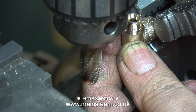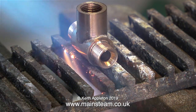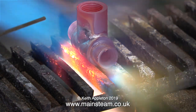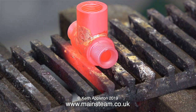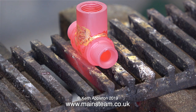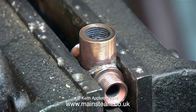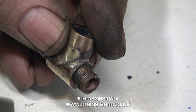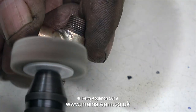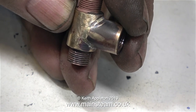When I looked in my box of assorted end mills I didn't have one that was half an inch in diameter, but I found a metric one that was nearly half an inch and had to move it from side to side a bit. All will be well once it's silver soldered — and talking about silver soldering, here we go. As usual I'm applying far too much silver solder — old habits die hard. After the silver soldering I left the part until it had cooled to black and then quenched it in water to remove some of the scale. It's fairly important to drill the hole down through the center of the top of this fitting into the main union — by doing that, water will come out of the tap when it's open. Normally I would have put this part in the acid bath, but to speed it up I'm cleaning it using my Proxxon motor tool fitted with a flapper wheel, which is also keying the part for the paint.